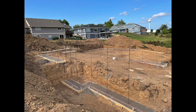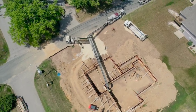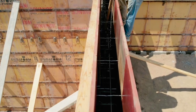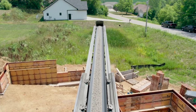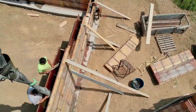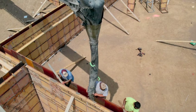That takes us to the footings, which are basically what the foundation sits on top of. As you can see, it has rebar that connects all of the footings to the walls once those are poured. Now we're to the level of pouring the actual foundation — all of the forms have been installed and are ready to pour concrete.